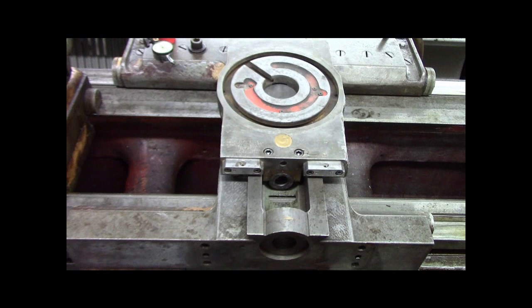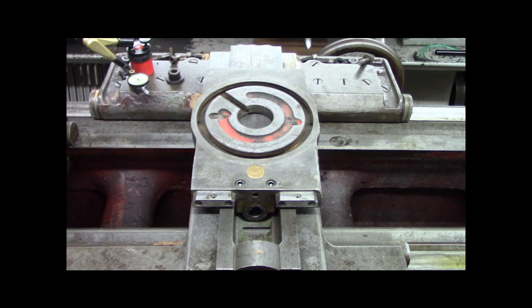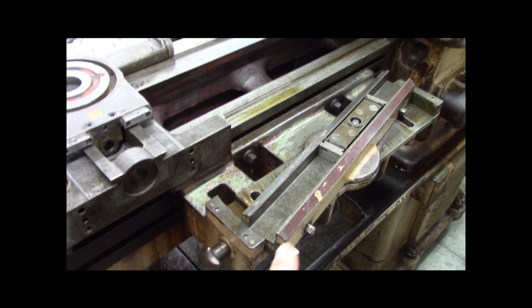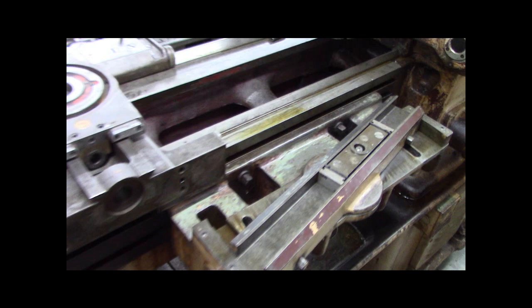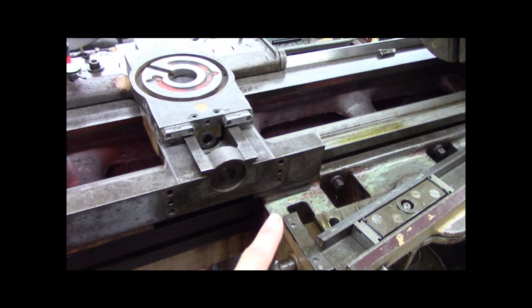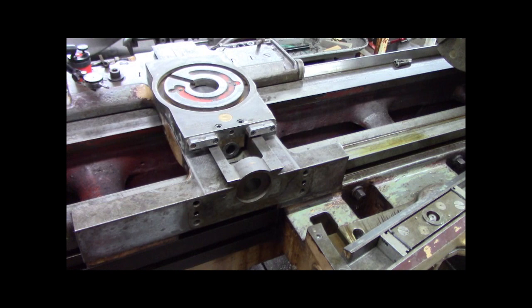So I got this on, and got this ready to put back together. I got the nut in there, the cross slide nut. But let's take you over to the bench and show you putting together the part for the taper attachment that bolts on the back of the carriage and allows access to anchor that sled for doing the tapers. And like I said, the problem was when you lock that sled out, it was having some sponginess, which is bad. So let's go over to the bench.